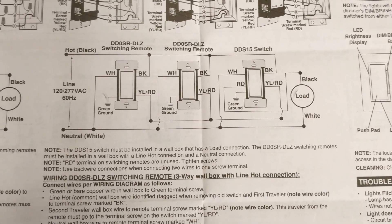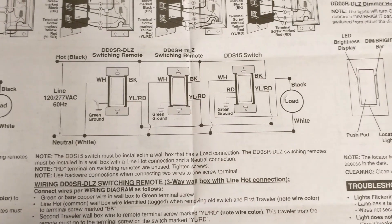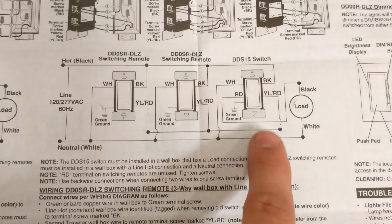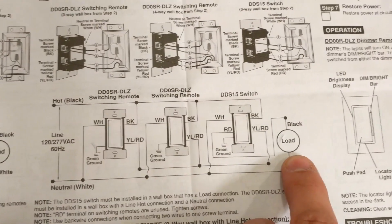When you wire this up, make sure that you find the last set in your circuit to put your master switch — again, towards the end, in this case towards your load or your lights.